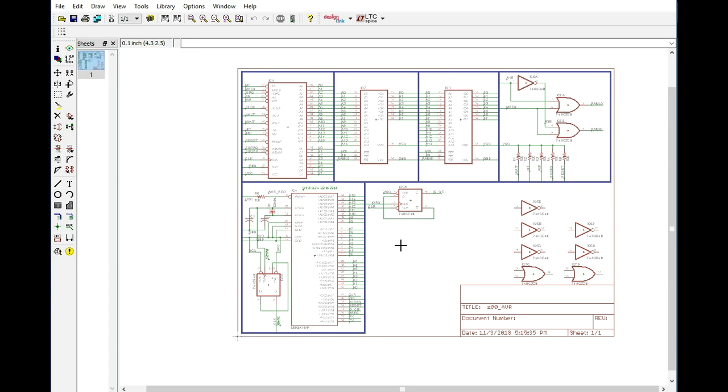It's going to be, what have we got here? 4, 5, 6, 7. It's going to be 7 chips, but it's going to give us a lot more, I guess you could say, wiggle room as far as the I/O handling is concerned, because we're handling everything in software. And similar to an 8080, we don't have an I/O space, we only have a memory space. So we're basically using DMA in order to put these values into memory.